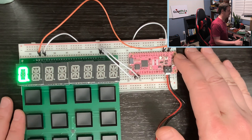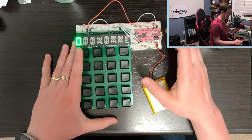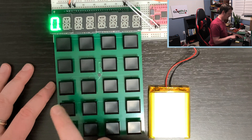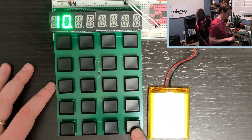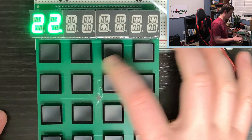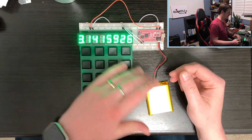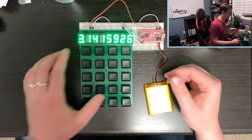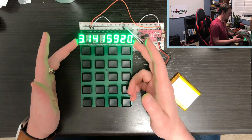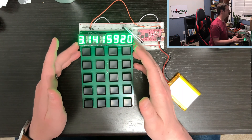I have programmed this RP2040. This works with reverse Polish notation. So if I go 10 and press the plus-equals button, I get 10. Then I press 12 and press plus-equals again, and it adds them. It does floating point math, not precise math. I put PI in and press enter — it loses and rounds that last digit. It's an imprecise number. When I do the final version, I'll need to use pure decimal math and can't rely on floating point operations.